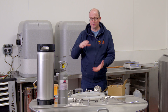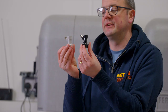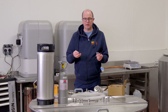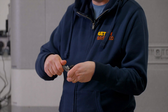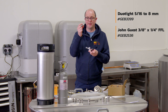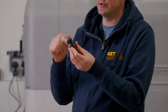Corny kegs are commonly connected using ball lock disconnects. The color difference is: lighter ones in white or gray are for gas, and the black ones are for liquid. There are two different types of fittings — John Guest and Duotight — both quick release. They simply thread on. This is a threaded 5/16 or 8mm Duotight version for the gas post, and this is the John Guest quarter FFL 3/8. Under pressure you won't want anything to leak, so consider putting PTFE plumber's tape on the thread before screwing it on.